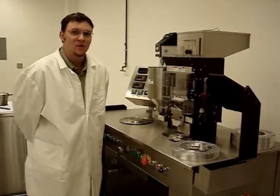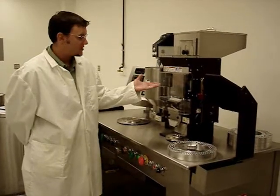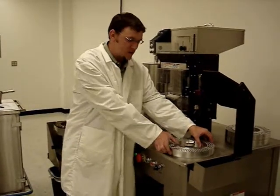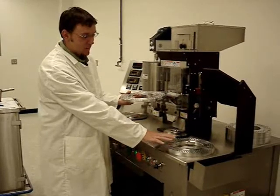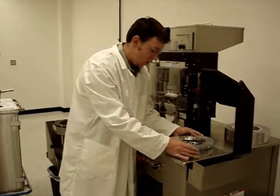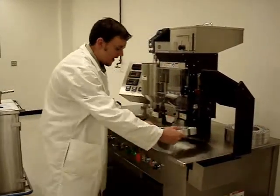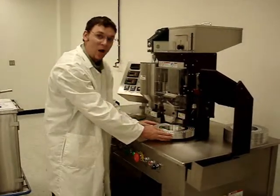This is the beginning of the capsule filling process. This is the rectification process of filling the capsule filling ring. This is a size 00 ring — it's a two-piece ring which holds the capsule bodies and caps. We're going to place the ring into the rectification station, bringing it in at an angle and turning it against the drive pin clockwise.